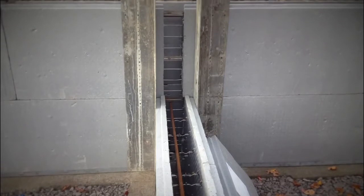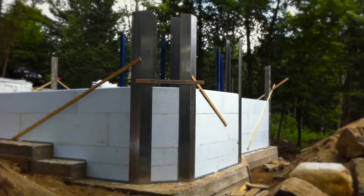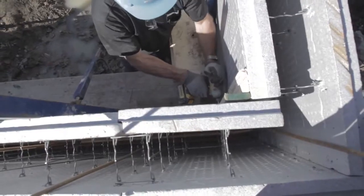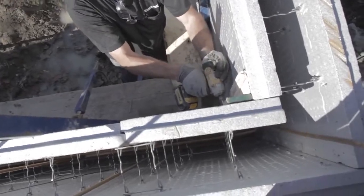In the case of a T-wall, we recommend to install 1 aluminum corner guide on each side of the T intersection. When the corners are closed back, the upper portion of the aluminum corners have to be attached together. Interior wooden corners are screwed to each insulated panel screwing points with 3-inch number 8 screws. This is providing a solid assembly at level point of the Polycrete walls.